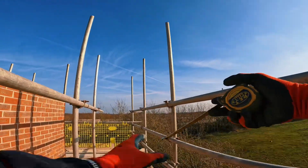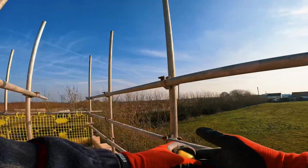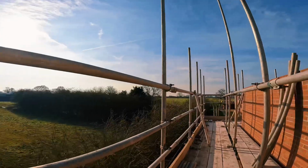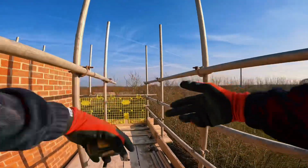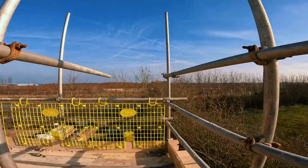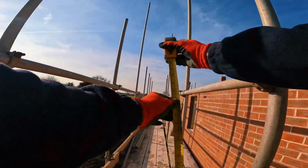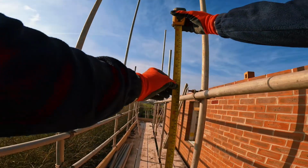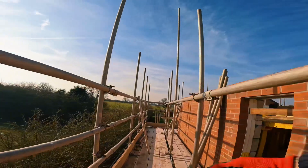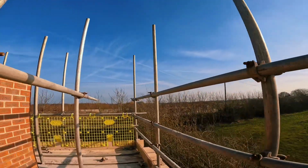110, my lifts are 110. My handrail goes 110 because my lifts normally work out 110. But every site's different, it could all be different measurements. You could be going 3 lifts, I go 4 lifts, so mine works perfectly at 1.1. 1.1 metres, which is 110 on the tape. Boom. Always in the red. There's your metre, 1.1. Measure up, use your scaff steps. Bish bash bosh.